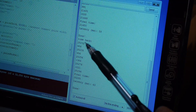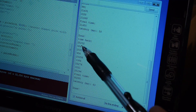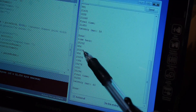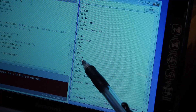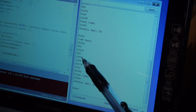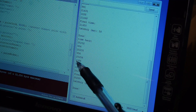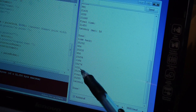Now what's really going on here is very interesting. We get the first time hack — basically the start time — and it reads 986, which is the baseline setting, just a low setting. Nothing has changed at this point; the receiver doesn't think the transmitter has sent any information other than the low stick position. Then about 6 milliseconds after the first time, it still hasn't changed. Then another few milliseconds later — about 18 milliseconds in — we start seeing a change. So at 18 milliseconds, it's saying 'we've now got a new servo position.' And then another 20 milliseconds later, we've got basically the final servo position.